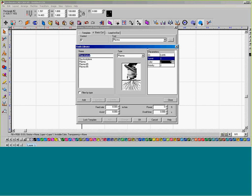The next feature is that we change the turret. This is the tool itself that is determined inside of here that the VMD will understand. In the VMD, we make all of the adjustments to number two, so we verify that our turret is number two. We want to change it to 1 because we want the plate marker to go first. And once we select those items, we can go ahead and click Add and add that tool into the tool library. We can go ahead and click Close.